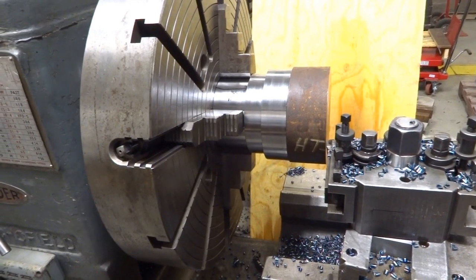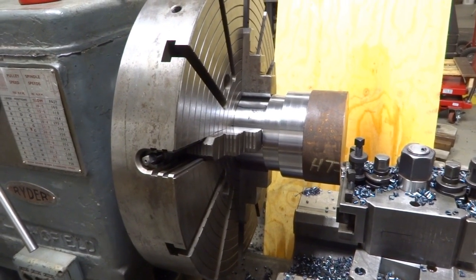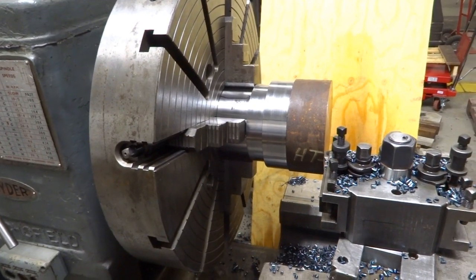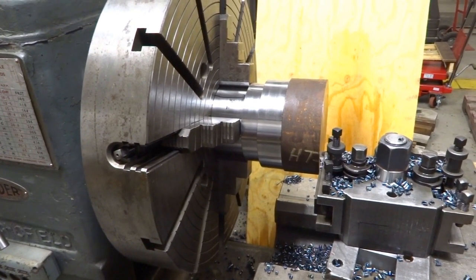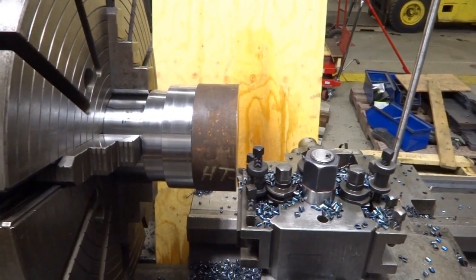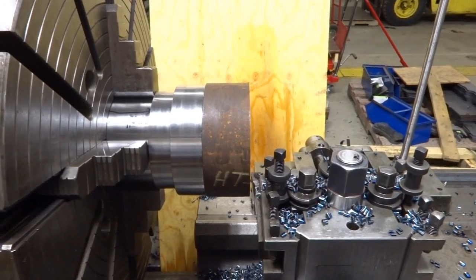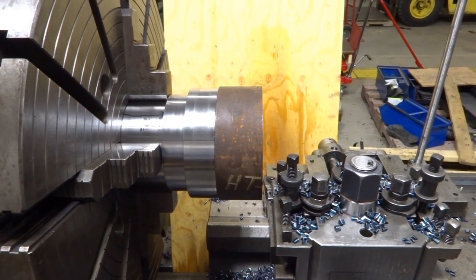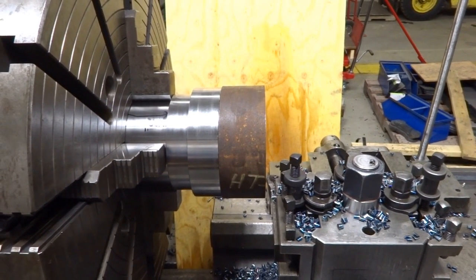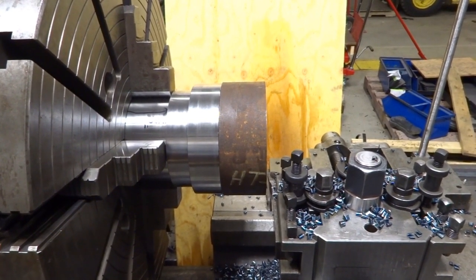I also think the inertia in the chuck would help. There's a fair amount of stored energy in that large chuck — it's 28 inches in diameter and weighs about 750 pounds, it's like a big flywheel. I would expect that helps somewhat. I don't think I would be able to carry out a cut like that along the length of the shaft for very long, because eventually all the power required would be supplied by the motor, the inertia of the chuck would not factor in, and the motor may trip out.